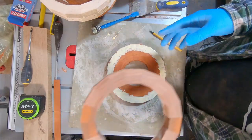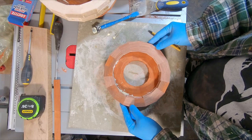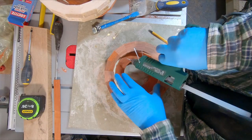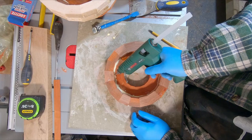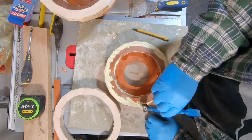Next up the middle section — for this I glued four rings, including the two maple rings. To try to prevent the rings sliding around whilst I clamped them, you can see me using hot melt glue to hold them. The hot melt glue stays flexible to allow good clamping pressure to be applied but keeps the rings in alignment. I didn't feel myself clamping them but it worked a treat.